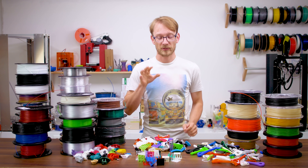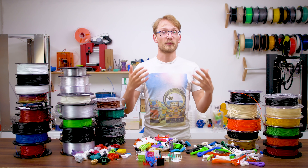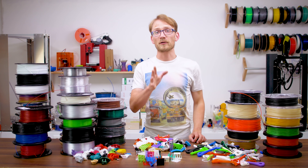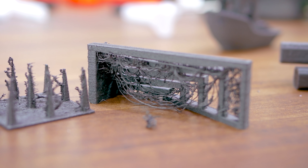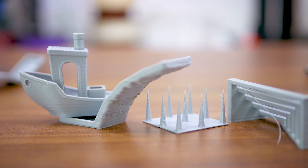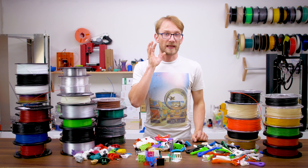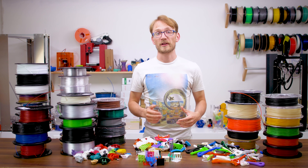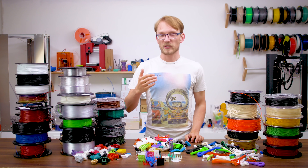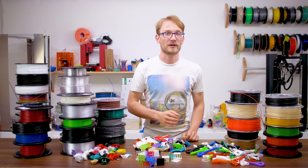Now, I didn't do a huge amount of tuning for any of these materials — instead, I relied on the manufacturer's data as much as possible. After all, that's how most users are going to use these filaments; not everyone wants to or even knows how to tune in a filament perfectly. I know for a fact that some filaments would have received better ratings if the print profiles were a bit better tuned for them, but for the sake of consistency between tests, I didn't want to start tuning filaments halfway through the season. That would have skewed the entire rating system. I started like that and wanted to finish like this, at least for the first season. Not a lot of manufacturers are all that good at giving the relevant print settings — which, if you're printing PLA, probably doesn't matter much, but when you have something like a highly modified PETG or nylon blends, chances are you're not just going to have a perfect profile sitting around for that exact material.